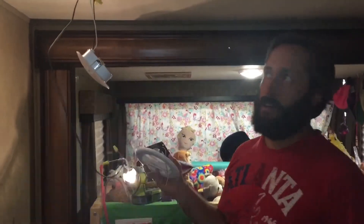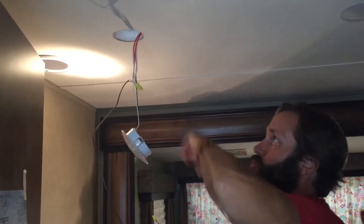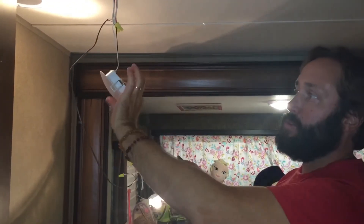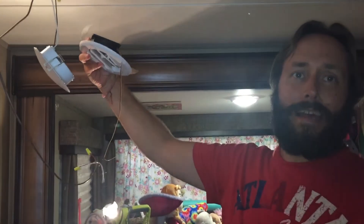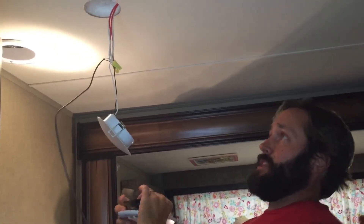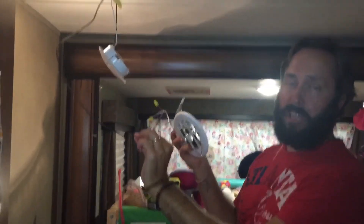As far as the install goes, right now I'm just doing quick and dirty. I'm going to run the cable on the outside from the little light puck that I took down and just run it up in here. Eventually I'll go back and try to clear a path so it'll look nice and clean. But really all it is is just running a little jumper from your 12-volt LED light to this little 12-volt fan — it's just your basic computer box fan. Right now I'll run the wires on the outside of the wall and make sure it lasts before clearing a path or using some TV conduit to clean it up. Pretty easy — a little 12-volt fan, some 16-18 gauge wire, a couple wire nuts, and you're ready to go.